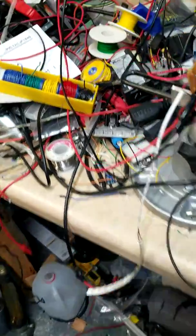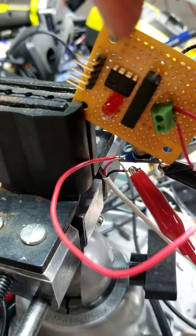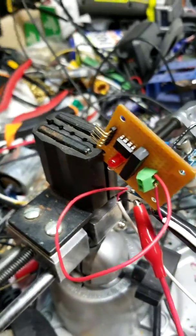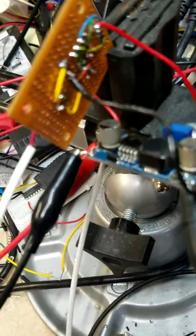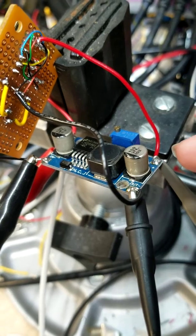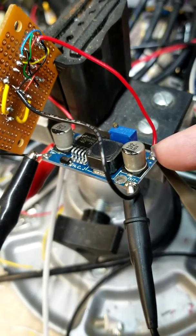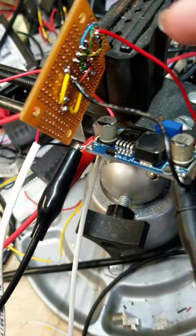For the gadget today, I use a little PIC processor shown right here, basically creating both a filter and a time delay out of a little processor. This is a little DC to DC converter which steps the voltage down from the bike's voltage of 12 volts when the ignition's off to about 13.3 when it's on, stepping that down to 5 volts for the circuit.